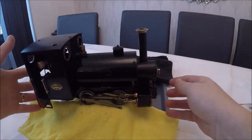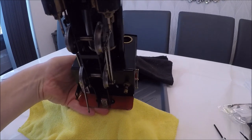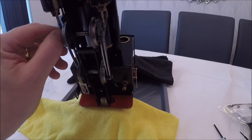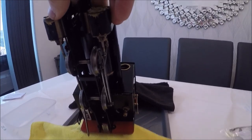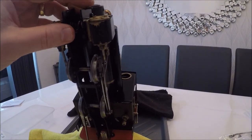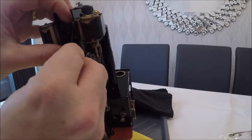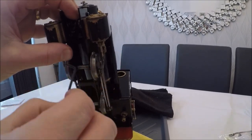I'm going to stand it up on the back. Just be careful now with the connecting rods because obviously they are now free-swinging — I don't want to catch one or bend one. With the cut-down 2.5mm Allen key, it's just a case of undoing the four bolts on the underside.